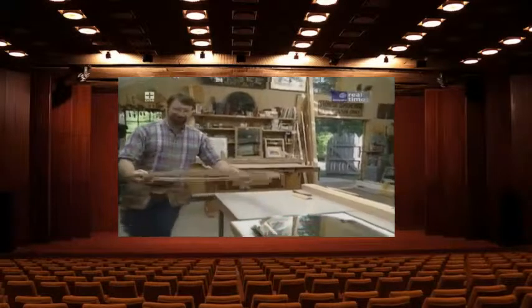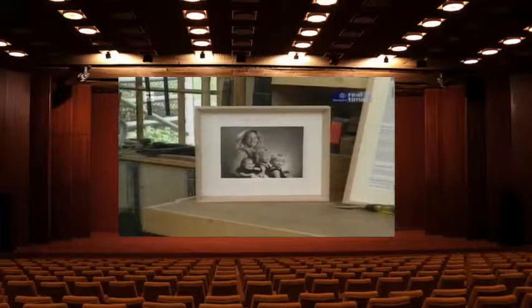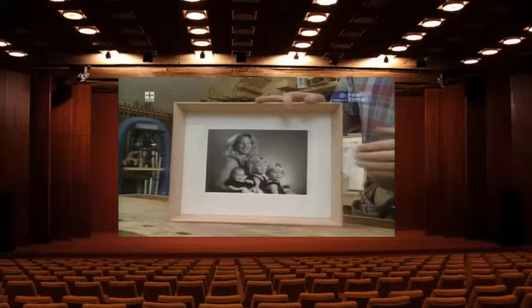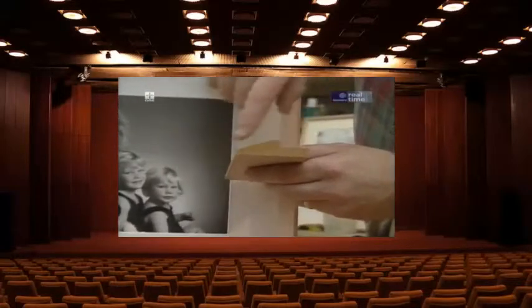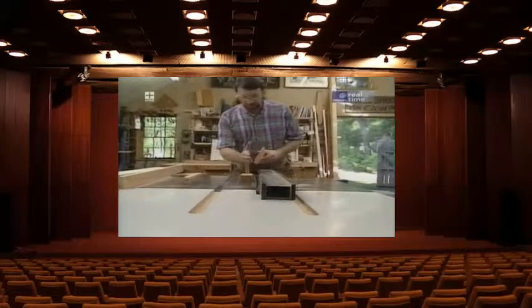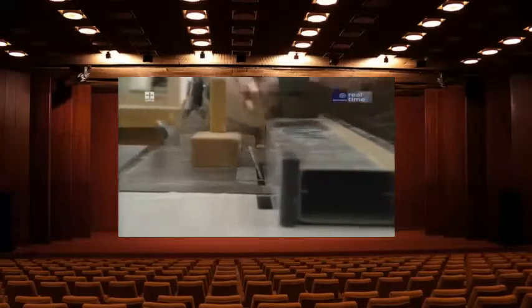After those joints dried overnight they're never going to come apart, and the frame still fits the mirror. For the shadow box frame made from pine, the mat board is beveled as well as the frame, which brings the eye right to the artwork. Looking at the cross section: it's rabbeted at the back, and the bevel doesn't come to a point — there's a little section of flat on the frame. At the table saw with the blade tipped to 20 degrees and the rip fence adjusted, the pine stock is run through on edge to produce that flat portion and bevel.